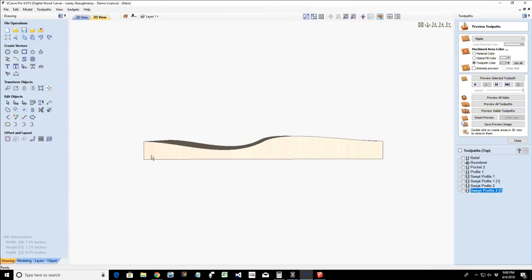Well, if I took this material, and let's say it was a little bit thinner, I could have a small thin piece of straight material across the bottom, being a totally different wood. Let's say that I had cherry, and what's a good contrasting wood to cherry? Zebra wood or something like that, or whatever the case may be. Let's say I want a solid wood, but let's go cherry. And I had a nice thin piece of cherry, quarter inch thick, what have you. I can glue that on the bottom of this here, and that's going to create the outer rims of my ring, the outer rims of the ring.